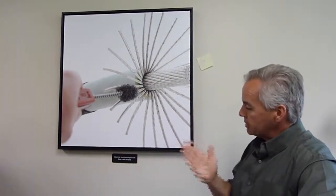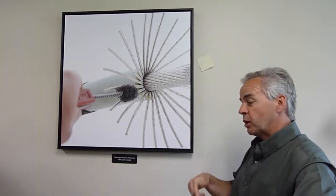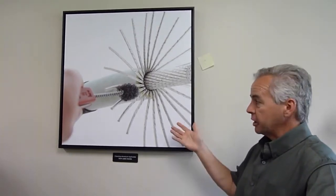So anytime you put an insulator between those layers, it's harder for that electricity to do that. And what electricity does when it struggles against resistance is create heat. So it gets hotter and hotter, and as the heat goes up, the resistivity goes up as well. It's called thermal runaway, and it'll actually cause it to fail.